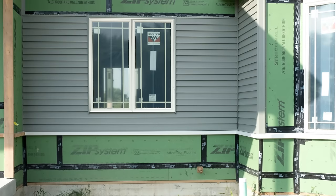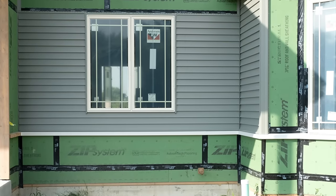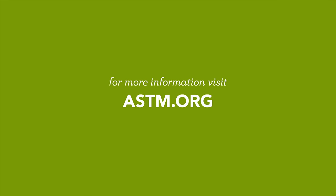If you are installing and flashing a new window, refer to the window manufacturer's instructions and ASTM E2112, the standard practice for installation of exterior windows, doors, and skylights, for the proper flashing installation method for the window type and wall configuration on the project. For more information about the ASTM standards mentioned in this video, visit ASTM.org.